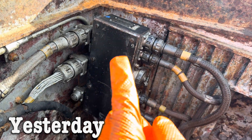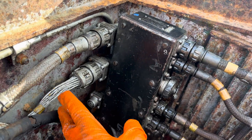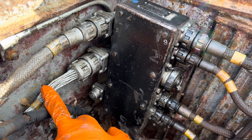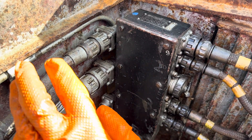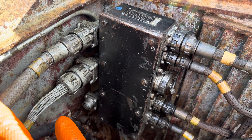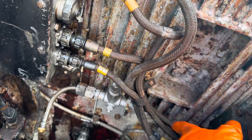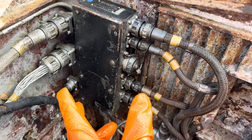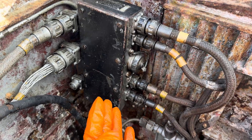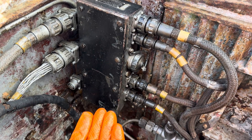So I found my controller box for the gearbox, also the lighting. A clever friend of mine told me that that cable is actually for service lighting, and this one here — the army cable — is for the gearbox controls. Anyway, that's plugged in. These wires then go off into the gearbox. And now that's on, I can go put power on again and see if pressing the gears selects any.